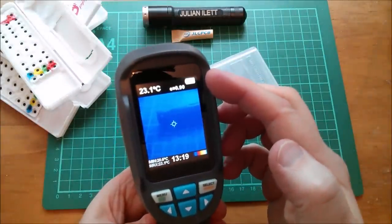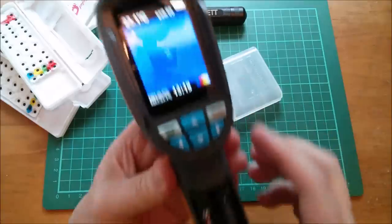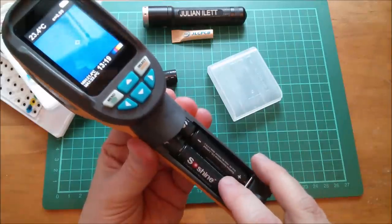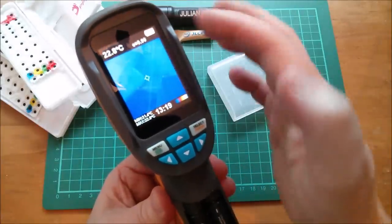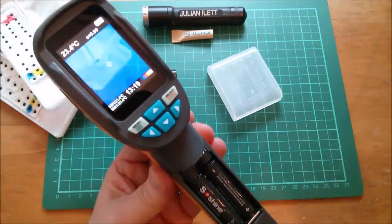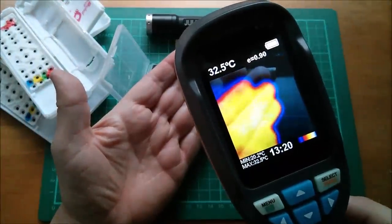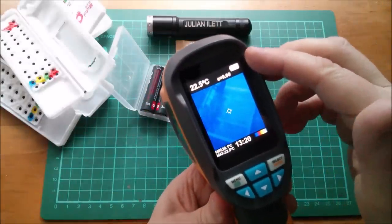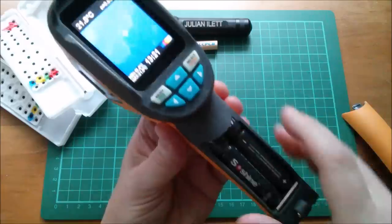Switch it on - on it comes, let's boot it up and see what it makes of this voltage. Oh look at that - absolutely full battery, no hint of any low battery problems! Yes, that's the solution. I bought these for two reasons - I wanted to test the ISDT 24-slot charger with LiFePO4s, but they do work very well if you're having voltage problems on your 4-AA device. There's my hot hand - yes, I've never seen the battery symbol on this thermal imaging camera completely full like that before. This is definitely the solution to use LiFePO4s and these dummy cells.